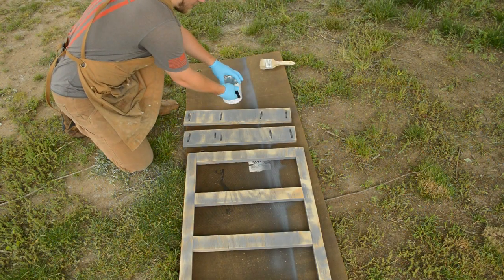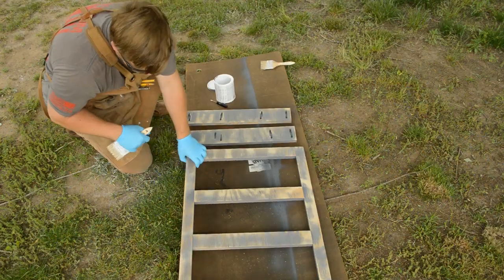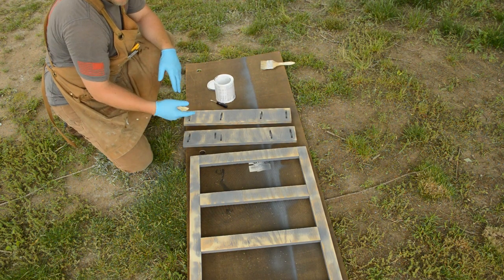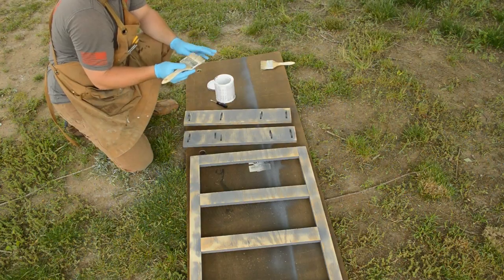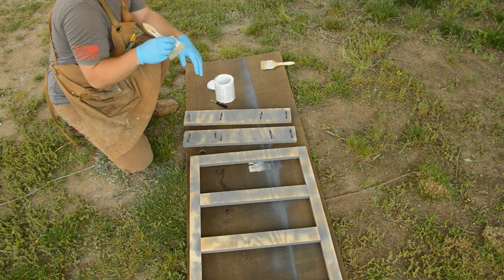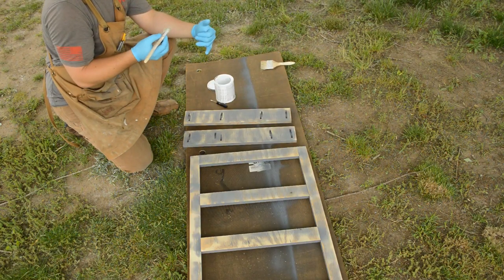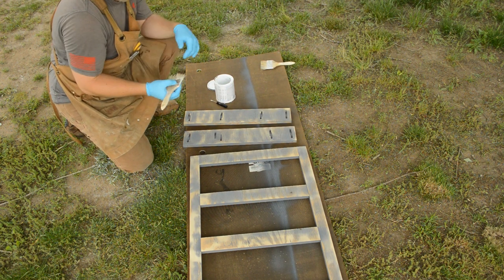I'm going to hand brush on the white acrylic, putting more emphasis on the front edge and making sure I get a good thick coat. I'll coat everything once for the interior drawer parts, but parts facing the outward side are definitely getting two coats. The only reason I'm being selective is that I'm a bit low on paint and the budget doesn't allow for more. So I'm being very stingy with where I put the paint — just enough to cover the gray — since these interior parts will be concealed and the drawers will be on floating runners with no contact on the paint itself.